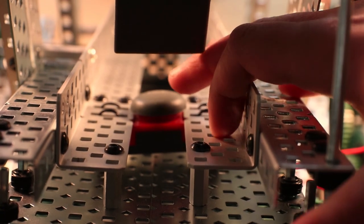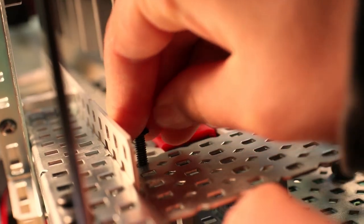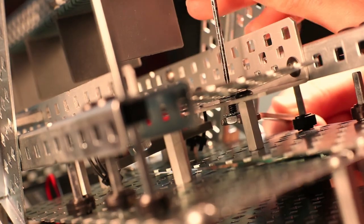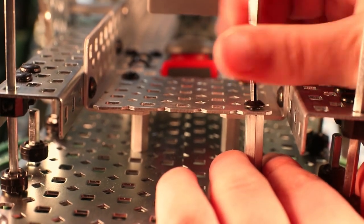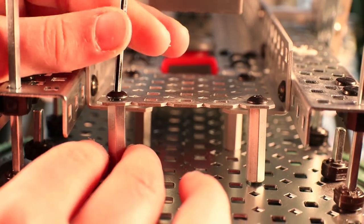You're gonna screw in that plate 3 holes down the center column of the angle pieces, making sure to slide the screws through 2 washers each before you slide it through the angle pieces. Then secure those with those cap nuts. In the front 2 corners, you're gonna use the remaining screws to screw in the 2 standoffs that will just sort of act as a stabilizer, and so they don't need to be secured on the bottom.